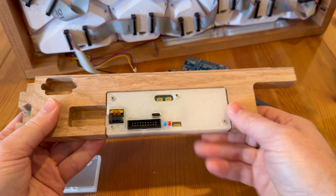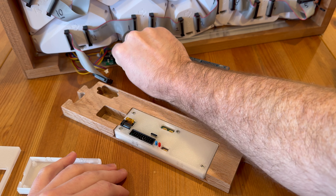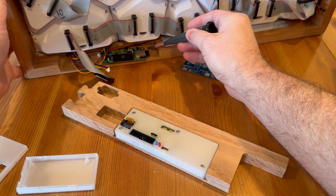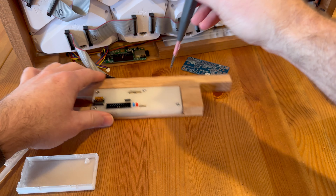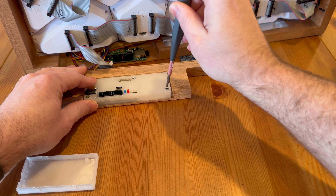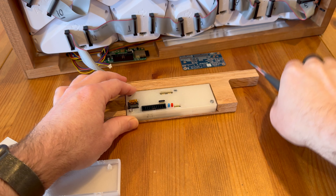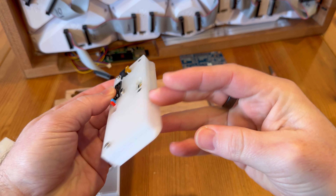One of the problems I was trying to solve is that if this board is installed in here with, you know, a case or something, there's no way to get in the back and actually unscrew from the back there. So I wanted to make it so it could be unscrewed from here and then just slide out, so that it's easy to service and replace if it needs to be replaced.